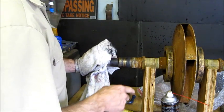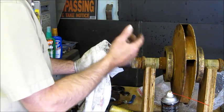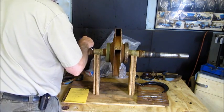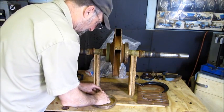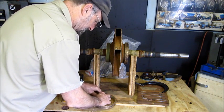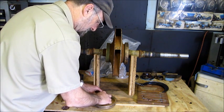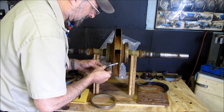Next, we're going to go ahead and do a measurement on the wear rings. If they're exceeding, we want to give them a call and let them know that they are exceeding with our findings. We're going to the thrust side here first, and we'll lift the ring on. We're going to go for high and low on here. And we already got the inside micrometer put together here with a little sleeve because we're over the half inch. So you go from the nominal inch up to a half inch without the spacer, then you add the spacer, then you go in there.